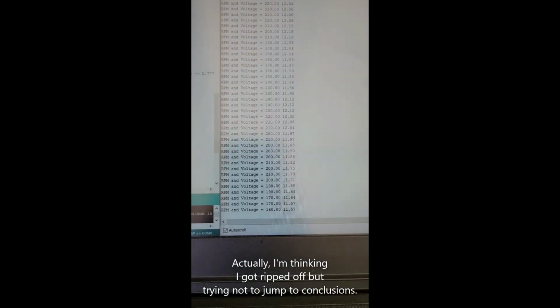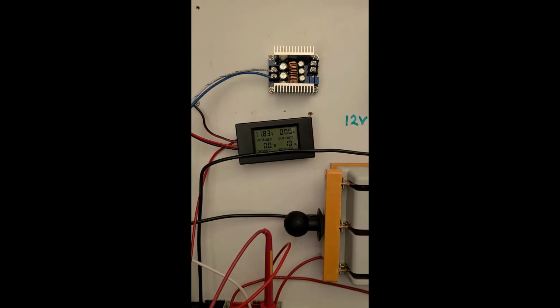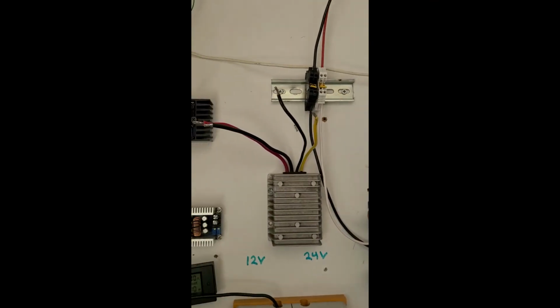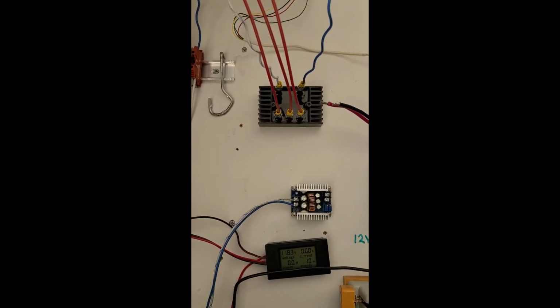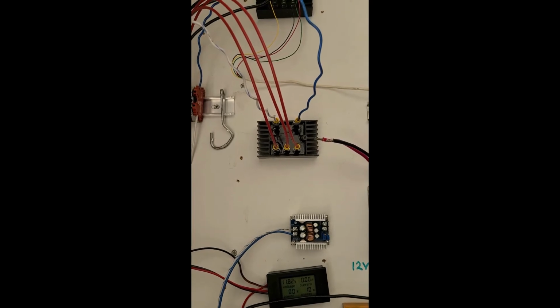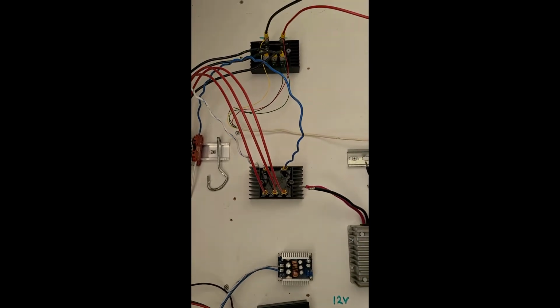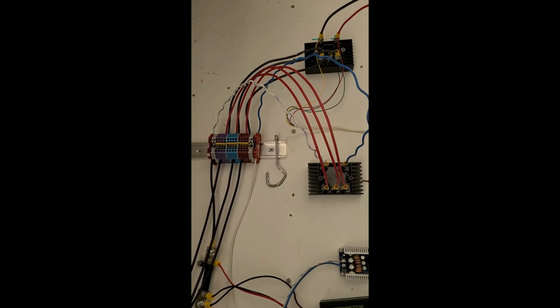And one thing I should explain is why these numbers don't match the 11.64239 on the voltmeter that I have hooked up to my batteries. That's because I'm measuring off of this rectifier, which is hooked up over here. When I hook it up to the lower rectifier, which goes to my batteries, I start to get some chatter in the circuit that I made. The Arduino reads in the raw data, and you have to multiply it out to get an estimated, calculated value. I didn't quite perfect the scaling on it, but I could figure all that out on my own if I needed to.